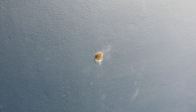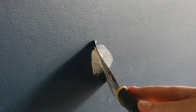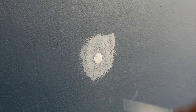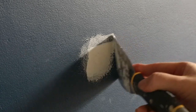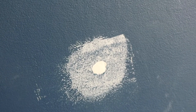Back to the hole. Just before I put the filler in, I'm going to take a bit of sandpaper and make sure there are no bits standing proud. I'd like to fill it gradually, so I'm putting a little bit on at a time. What I always do is go on in one direction and then take the excess off in the opposite direction — if you go over the same way twice you risk pulling the filler back out of the hole. So always go on in one direction and off in the other.